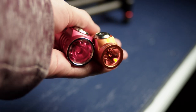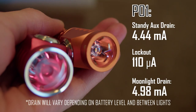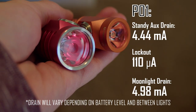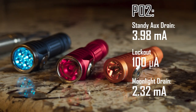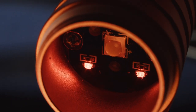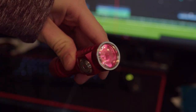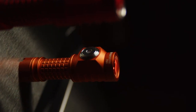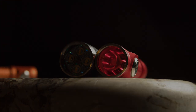Another issue is the auxiliary drain. These monochrome LEDs are only able to run at a single output level that is quite bright at half a lumen, which is enough to be disturbing once your eyes have been dark adapted. Worse, these aux lights have a very high drain, which quickly kills the batteries even when the lights are not being used. The way around this is to lock out the lights, either in the UI or mechanically, which isn't a big inconvenience, but a much nicer solution would have been to simply have a lower aux output level available.